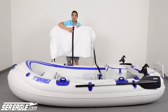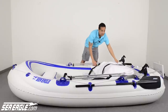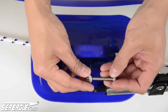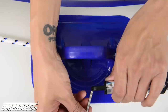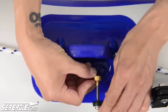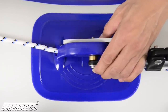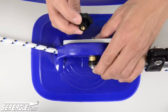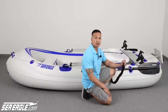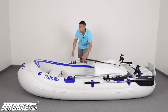Take your canopy and with the center black strap facing up, set it on the rear of your boat. Line the ends of your canopy up with the canopy bracket on the boat. Take one of the bolts, slide on a washer, slide that into the canopy from outside the boat inward, and slide on your brass insert. Insert that into the canopy bracket, slide on the canopy plate, then another washer, and secure it with the knurl nut. Repeat these steps on the opposite side. Attach the rear canopy straps to the rear oar holder clips, and attach the front center strap to either grommet at the front of the boat.